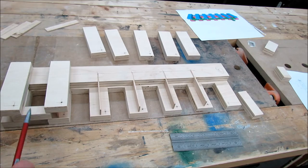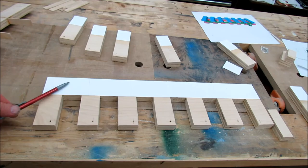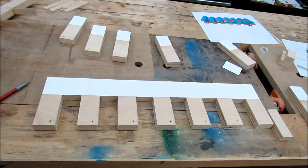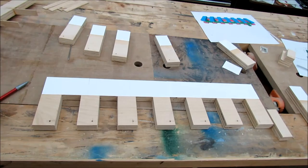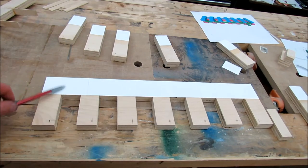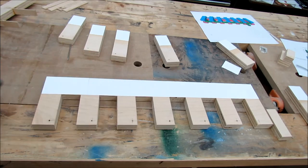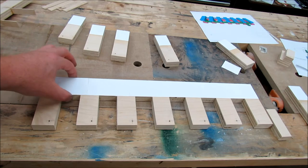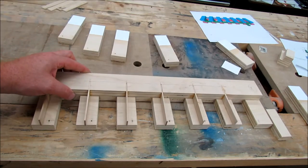The first thing I did to the foundation piece was to go ahead and glue my shims to it. I just used spray contact cement to hold them, and then once you put your wood glue on, that'll bond just fine. The business card shim is two inches wide, which fits perfectly, and then you lay your springboard on top.